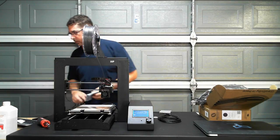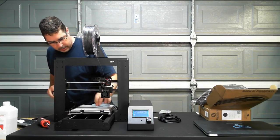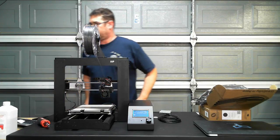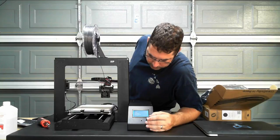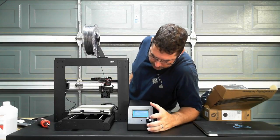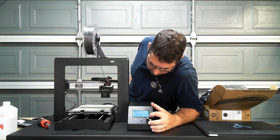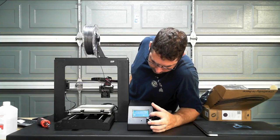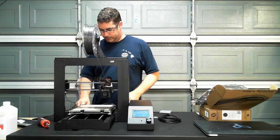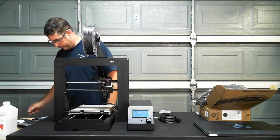since we let that sit so long, just for good measure, I'm going to reapply some hairspray. Okay, we are going to go to play, SD card, system volume, PLA 5mm calibration tube. We're going to watch. Right now it is at 200, heating to 200. The bed is at 30, heating up to 60. And we'll see if it prints at this point. Then we can call it a day, say yay, fun. And see where everybody goes.